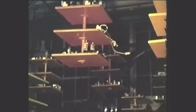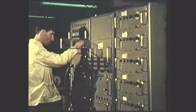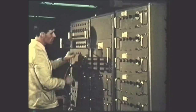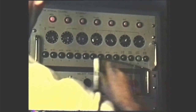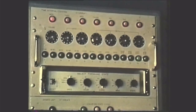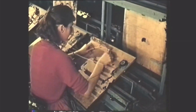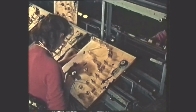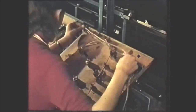Altogether, four conveyors supply the assembly lines. The flow of each assembly line is regulated by a central electronic control unit which ensures that each sub-assembly line works at the same speed as the main assembly line. Auxiliary tracks provide cable forms, mains leads and other components. The matrix on which the cable form wires are set is indexed throughout its various operations and returns automatically to the start of the track when the form has been completed.